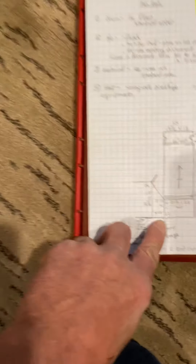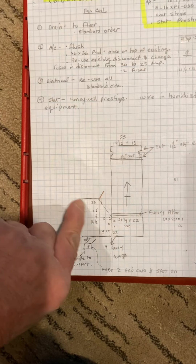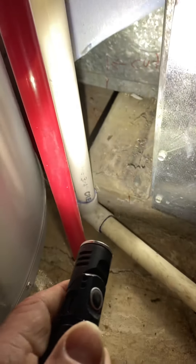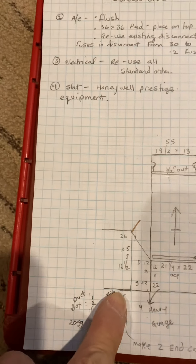This is super, super tight. This here is the existing return air duct. I have a cut line right there. I made this little duct box, 20 gauge, with two end caps. You should slip this under here before you cut this.